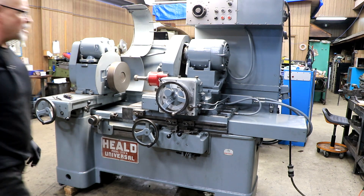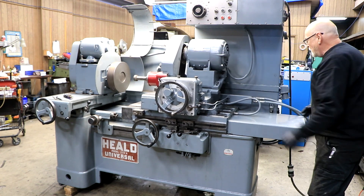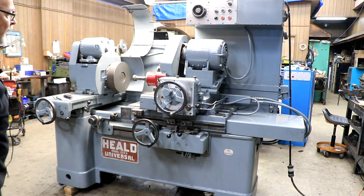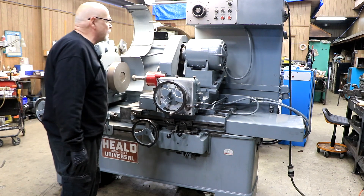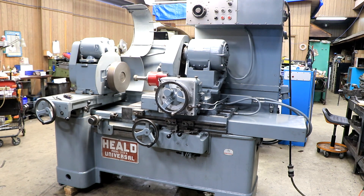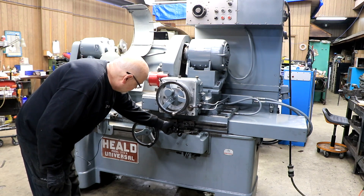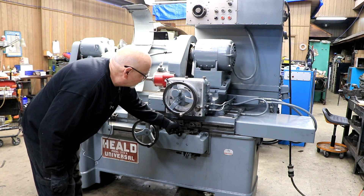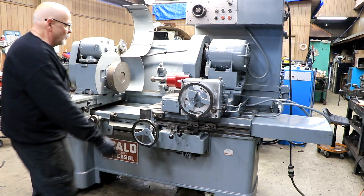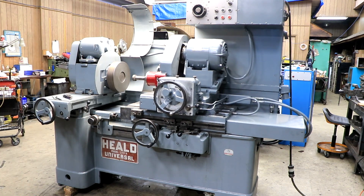So I made an adjustment on this cam over here. It's not the switch you have to adjust — it's actually a sliding cam that you can slide back and forth. But every time you set this machine up, it depends on where you have your stop set, how close you're coming into the headstock, and a whole bunch of stuff. So you're going to have to adjust that cam from time to time. Now when I back out of here, it makes that switch and shuts your work piece off for you. And then when you want to come back in, it comes back on — and that's in the auto mode.